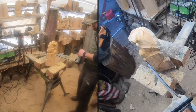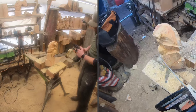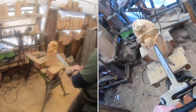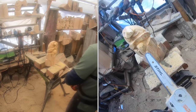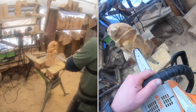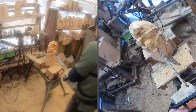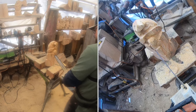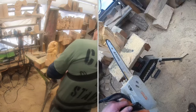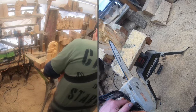There's a hard corner here, so I'm removing it to round up the top of the mustache under the nose just a little. Define where the inner side of the mustache is going to be with an angle cut. That's the top of the mouth — the lower part of the mustache under the nose — and that's where the mouth is going to be. Scraping across with the nose of the bar will define where the lip curves up and out a little, giving you a place to start the hairs below the lower lip.